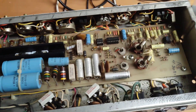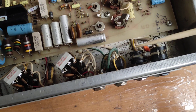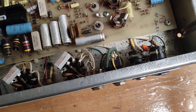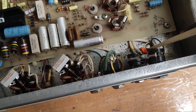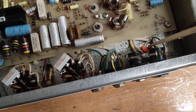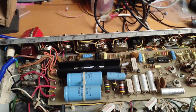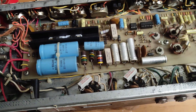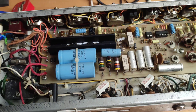This one is a bit of a weird one — somebody has actually modified it and added an effects loop. But they've tapped it from the 12AX7 ECC83 tube, which is only used for the limiter — that's the overdrive circuit. The clean channel is actually an all solid-state preamp driven by that op-amp over there, so tapping the effects loop from the tube is a bit bizarre.